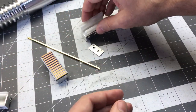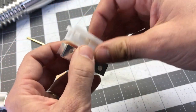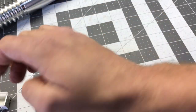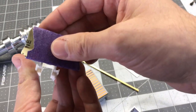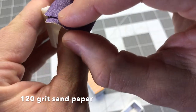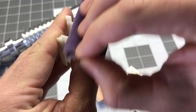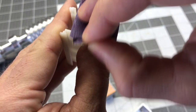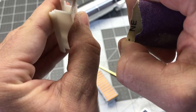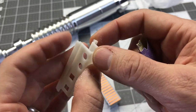Back to the assembly — this is the 3D printed insert. You'll notice when you try to put it in at first, it's a tight fit. Don't just apply pressure — these are quite fragile. All you'll need to do is sand here and here, just a little bit on the edges, so that there's no resistance. Mine took barely any sanding. Be careful — it's really only the bottom that you need to do, and you don't want to hit these areas as you don't want to leave sand indentations here.